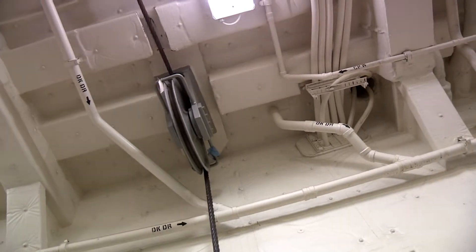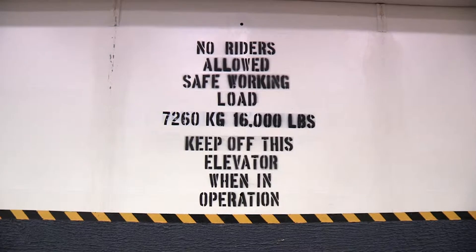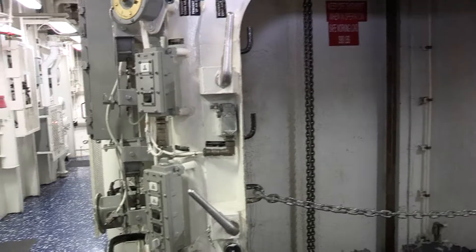All guide rollers should be free and functioning. The elevator pit should be clean. The platform should be level and not bent. Cable should be clean, not frayed, straight, and running smoothly on the drum.